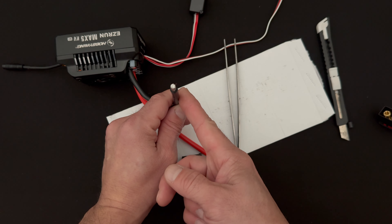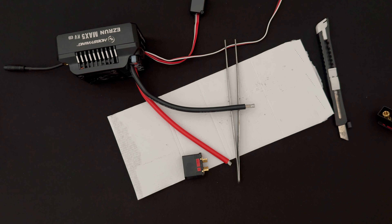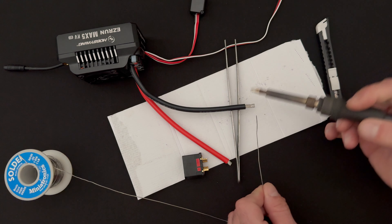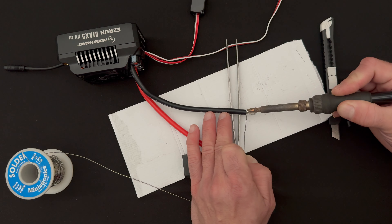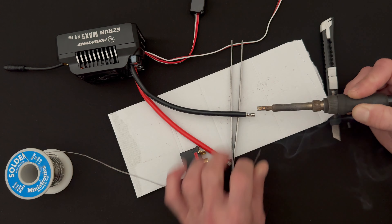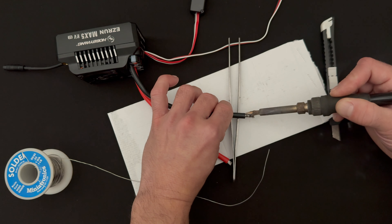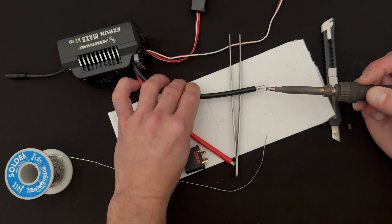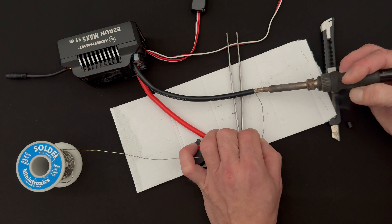Make sure your wires don't angle when you tin them because the solder will run down into the wire and makes for a poor connection. You want to use as little solder as you can while still using enough - too much solder can be bad, not enough can be bad. When I do wire tinning, I get it flowing and feed the solder in, letting gravity do the work of getting the solder down the wire so we're just getting a little bit on the outside. This keeps the wire from fraying so errant strands don't cause problems.